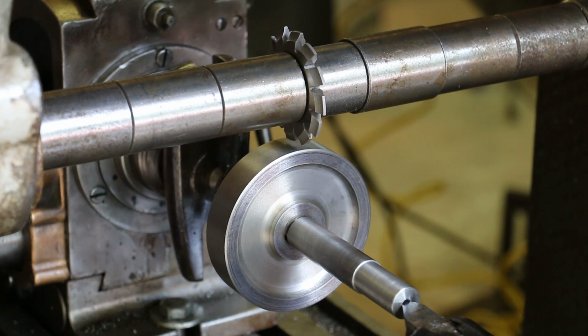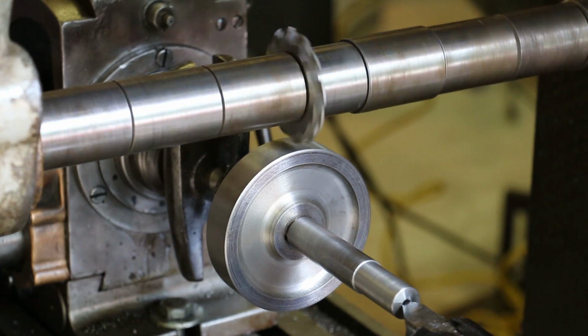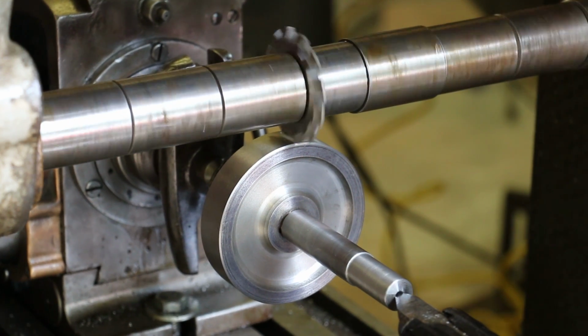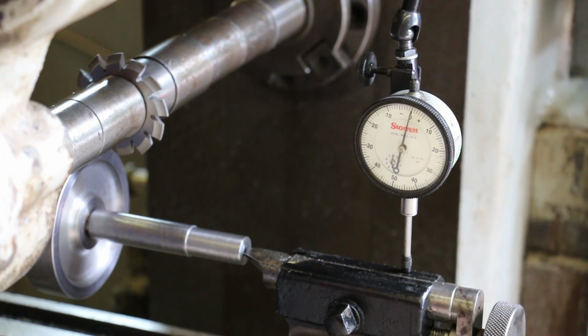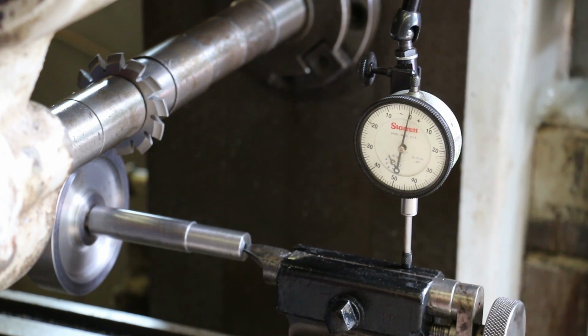So right now, what I want to do is I want to start the mill up. Put it back in gear. There we go. I'll start the mill up, and we're going to raise it up until the cutter touches off. All right, it touched right there. We're going to raise up the table 100 thousandths to 1 full circle on the indicator. Right there.